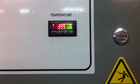Your temperature strip was showing 400 and now the display is showing 400, so the temperature controller is calibrated to the temperature strip. Usually when you do temperature strips, I like to do it three times: do it once, let it settle out, come back up to whatever temperature you've got it set for, run it 10 to 15 minutes, then run another temperature strip through. If the temperature is good, you're all set.